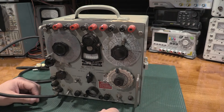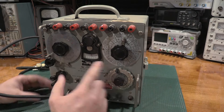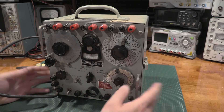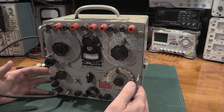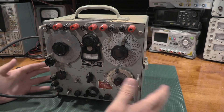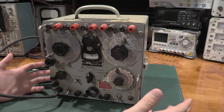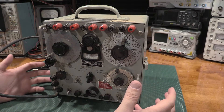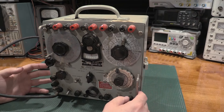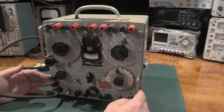In the case of this thing, there's not a lot of information out there, so I've got to dig. I even have to find a calibration routine. This is a military unit — the paint color actually tells me it probably came from the Navy side of things. The Army tended to paint things green; the Navy tended to paint things gray. The 576, for instance, has a transformer that's known bad. Some of the 500 series scopes have problems with the high-voltage transformers — common failure modes that could save troubleshooting time on the bench.